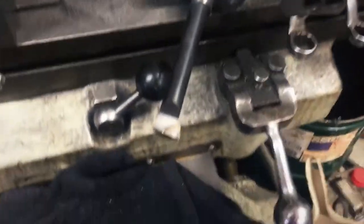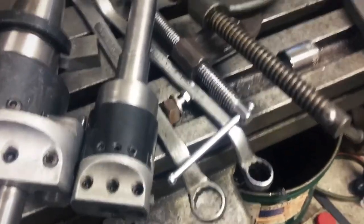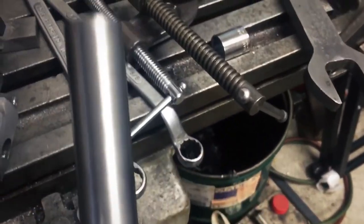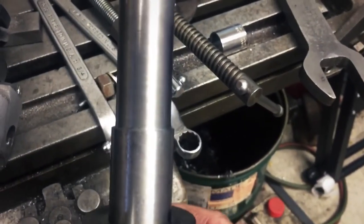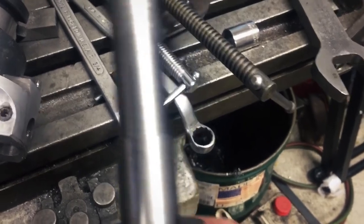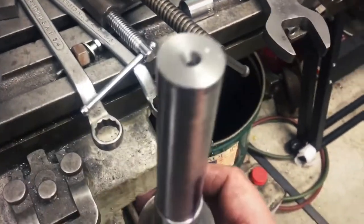This is what I came up with as the final setup right here. Take a look at that. So basically, I machined a long adapter. And here again, I tapered it down. It's inch, but I tapered down to 7/8 because I couldn't find my inch collet, which I then did find for here. But it's 7/8, still not that bad.